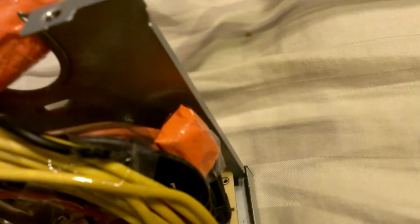Last video, I have done that. What I have is my red. Basically, here's the wiring here, guys. The yellow is connected to the red, because that's positive. The black is connected to the blue, which is negative, okay? So what you're going to do is you're going to have, I believe, 15 or 16 black and only 7 yellow, okay? You can just cut the rest of the black and tuck those somewhere, because you don't need those.